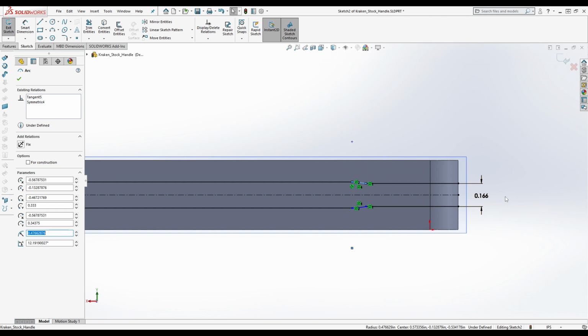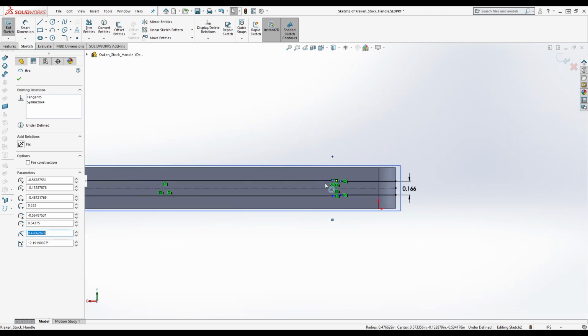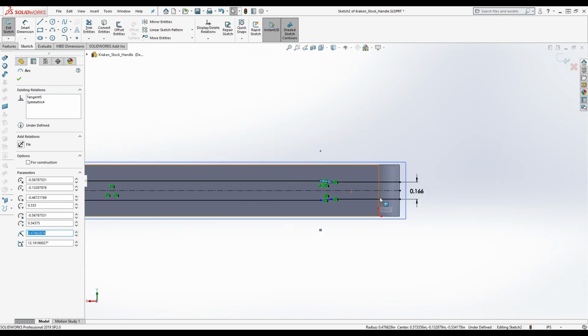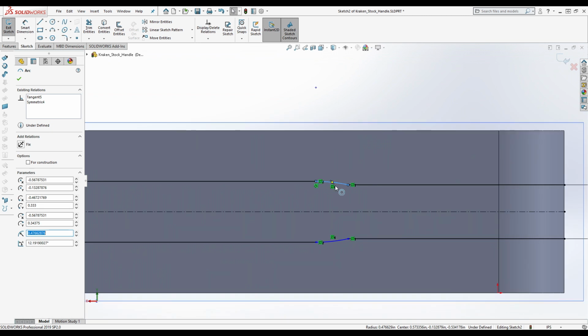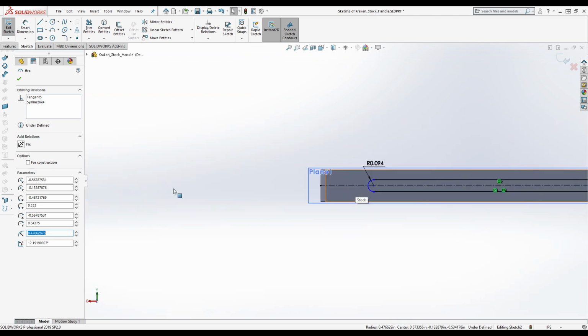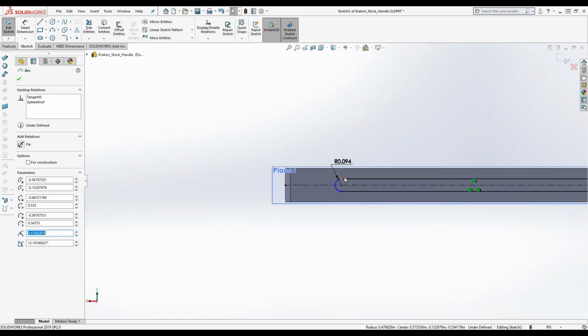So that's the thinking behind this, is that this is probably 5/32 of an inch or more. So it's either 3/16 or 5/32. And I'm going to make it 3/16 of an inch because you generally don't want to be cutting an inside radius like this using the actual diameter of your tool, because you get a large increase in tool engagement. With this, less so, because you're just not engaging that much, but cutting something like this, you're going to get a substantial tool engagement.